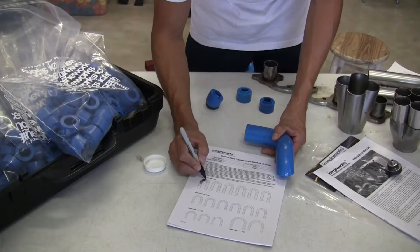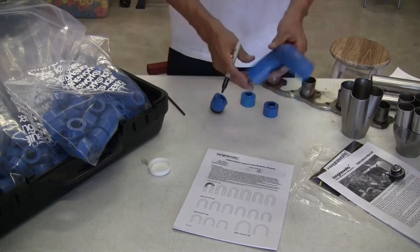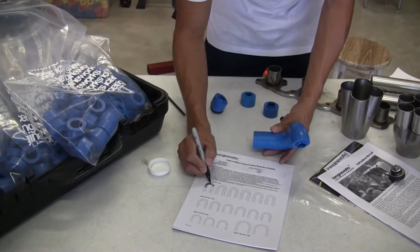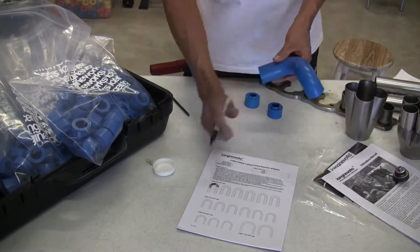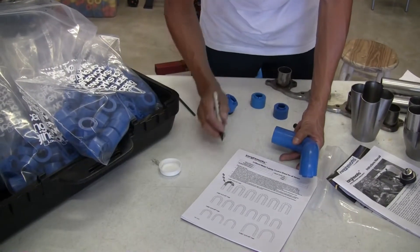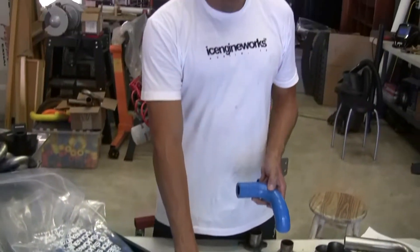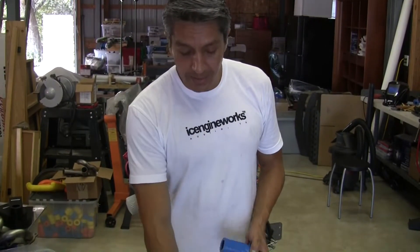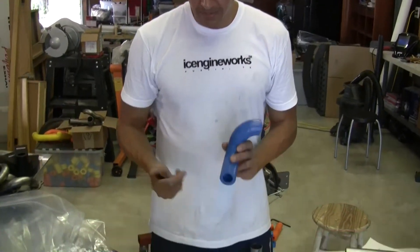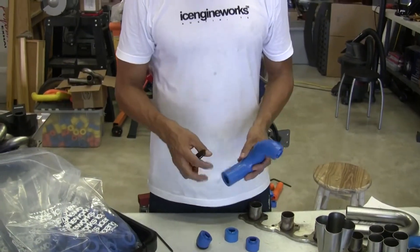We use the other three blocks in a U-bend. To produce this, I need only one U-bend or J-bend, and I need to make three cuts and one weld. All of that translates into time and money — I know how much this is going to cost. I can estimate the cost of cuts and weld time, and I can realize the total cost before I've even touched metal. That is the power of this system: it gets you very close to what you want and gives you all the information to decide whether to go forward or tweak it.